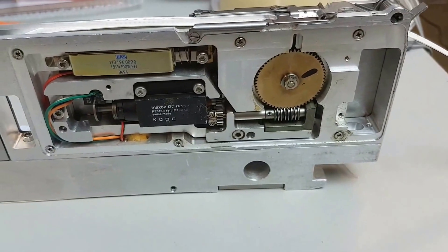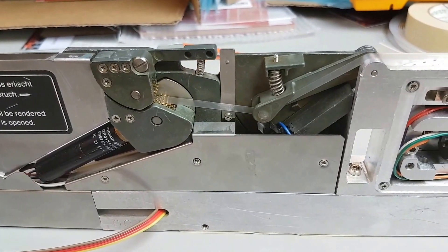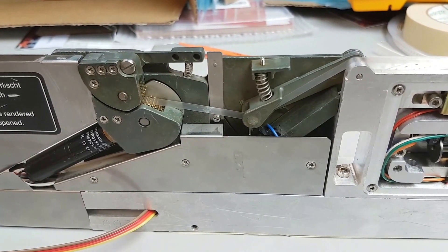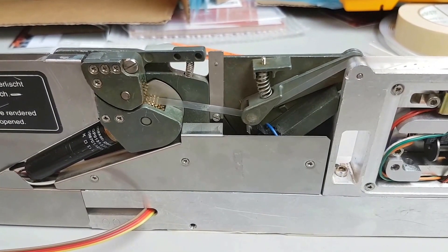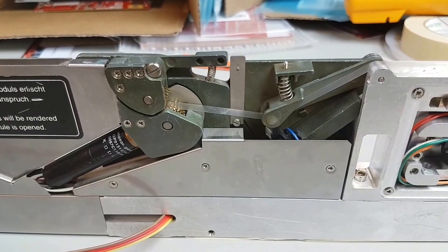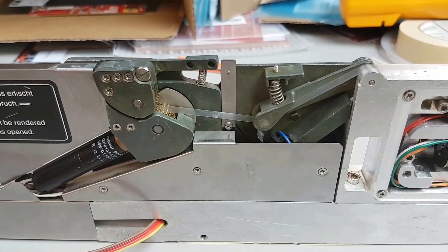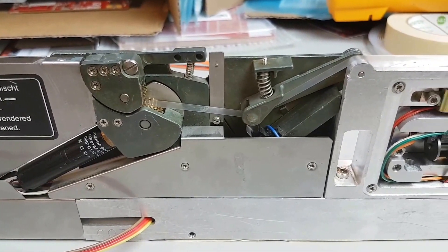So it's working pretty reliably so far. I'm pretty happy with it. This is the first time I've tried it with the cover tape pick-up on there, and that seems to be working pretty well. I could probably do with a little bit of hysteresis to stop it from constantly firing and releasing as that tape stretches and pulls itself back as the motor lets go. Maybe even just turning the brake on the motor might do something, but I doubt that.